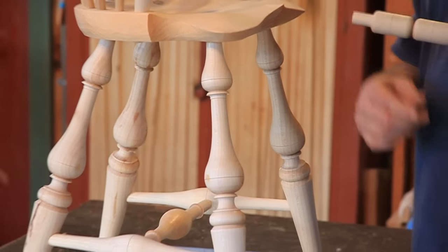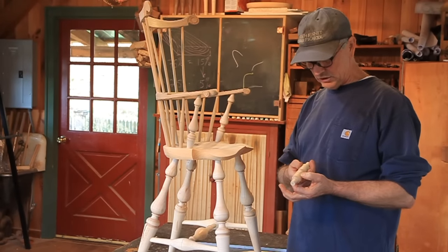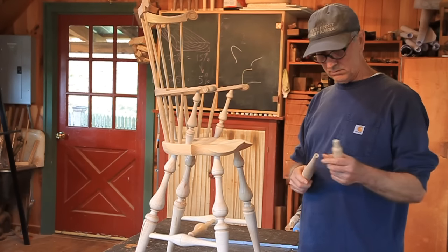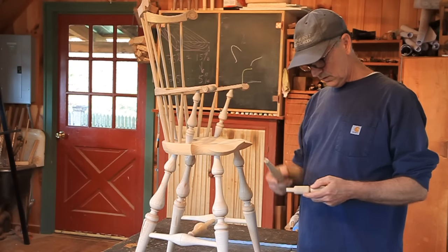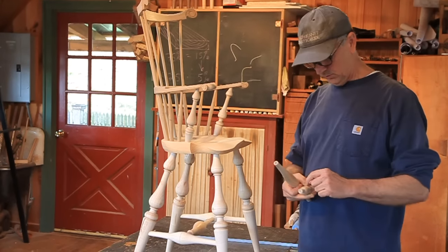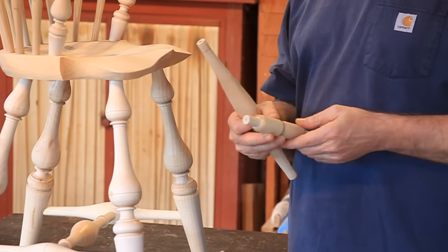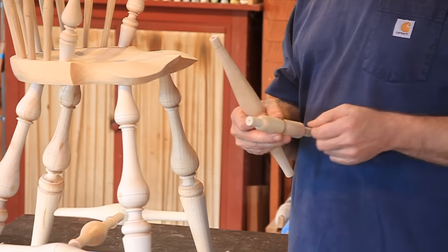These are little knobs and they're an inch and a sixteenth. I want the tenon to go five-eighths deep. So that's the center point, which would mean I'm only at a half-inch point in there — well, a little more than a half inch since it's an inch and a sixteenth. I'm a thirty-second deeper than that, so I need to go three thirty-seconds more on this side and three thirty-seconds more on this side.